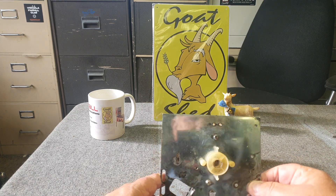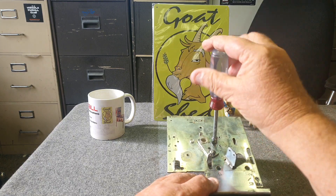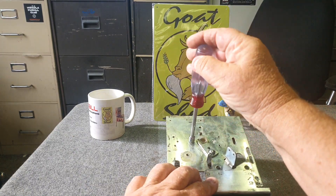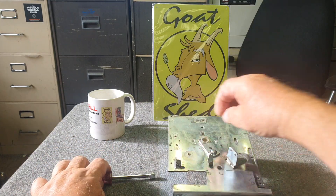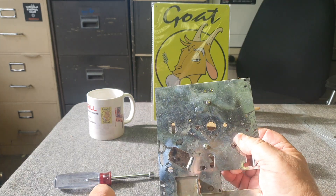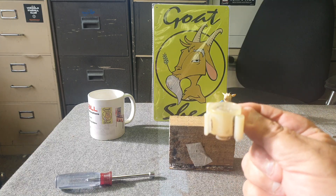I'm going to show you what the problem was. I missed it at first and had forgotten I'd had the problem before. All we need is a quarter-inch nut driver to undo these two nuts here. We've undone those two nuts and this just pulls out like that. There's the bearing — remember this isn't the one that was in question so it's not very clean.